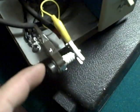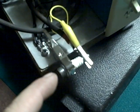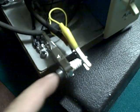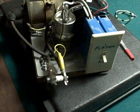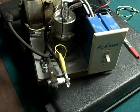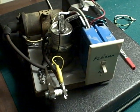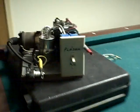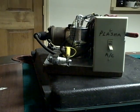If the gap at the spark plug is too narrow, the electrode can fuse across and cause a direct short. So we always want to be mindful that we have a big enough gap and that we don't overwork the spark plug and start to get buildup of slag, because slag will conduct and that will cause a short. I'm going to go ahead and zoom in.